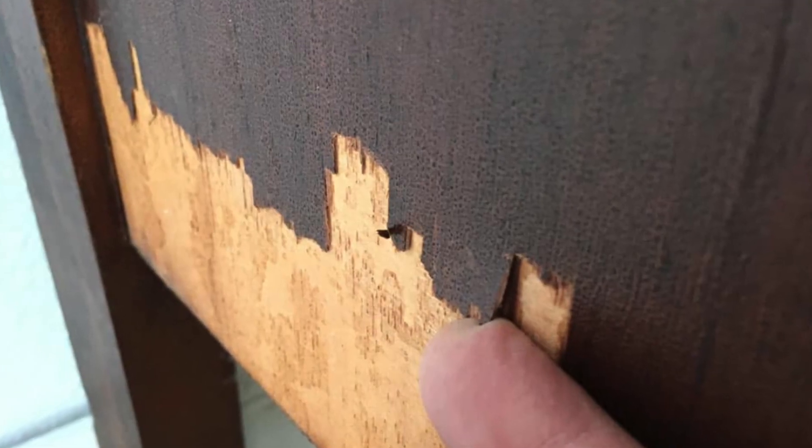Level of damage. The first thing I look at is chipped veneer. If it does have veneer, what is my intention with this piece — do I want to stain it or paint it? If you want to stain it, chances are you don't want any chipped or water-damaged veneer because you can't really patch that. In order to replace it, you'd have to take off the veneer and put a new sheet down, which I've never done. I usually stay away from that if I intend to stain it or strip it down to natural wood.